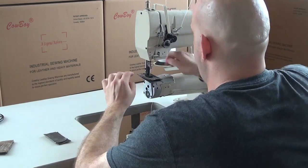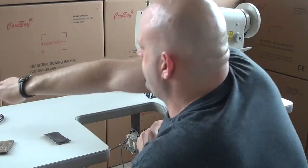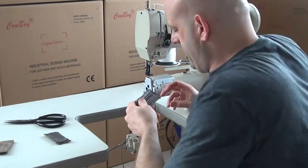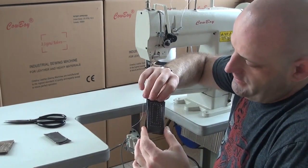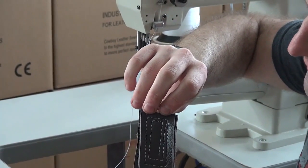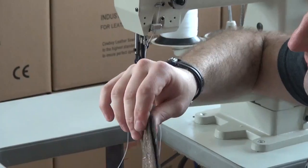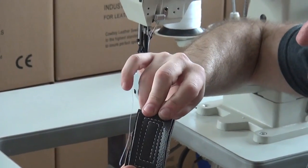I'm just going to back up a few stitches so you can see how it does in reverse on the four layers. I'll go ahead and extract the material from the machine. You can see on four layers of material, this machine has performed very, very well with a size 138 thread. The top stitches look very good, and if we flip the work over on the back side, you can see that the stitches are pulled up very evenly. With this being four layers of three to four ounce upholstery leather, this is well over a quarter inch — it might be heading towards three-eighths of an inch thick — and this machine performed very, very well on it.